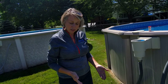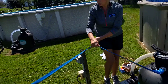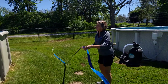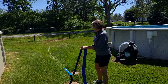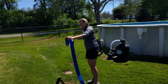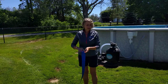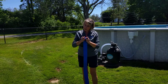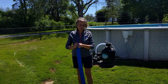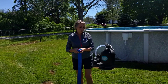That is the functionality of your sand filter. Make sure when you're done, roll off your backwash hose — just walk out the water like so. The chlorine, the sun, everything will dry these guys up. These backwash hoses — you're probably going to whack it with a weed whacker like I do every once in a while; they're not too expensive to replace. Make sure you walk all the water out of it and then roll it back up and set it next to there. Another good thing to remember with your backwash hose: unroll it all the way before you turn it on backwash. If you don't and there's too much pressure, that hose is going to explode and you're going to get water all over yourself.